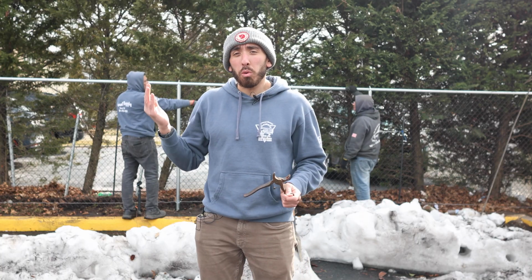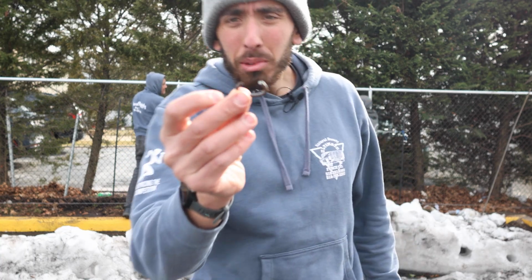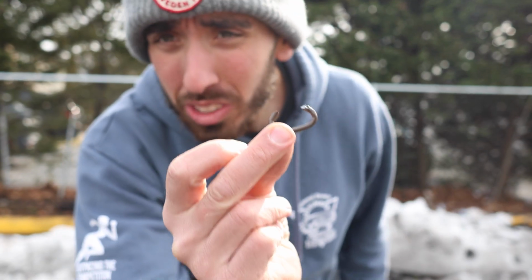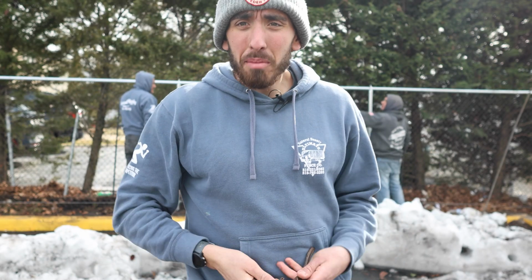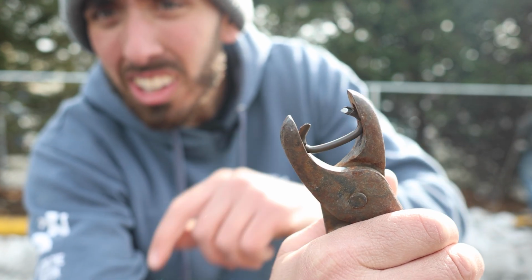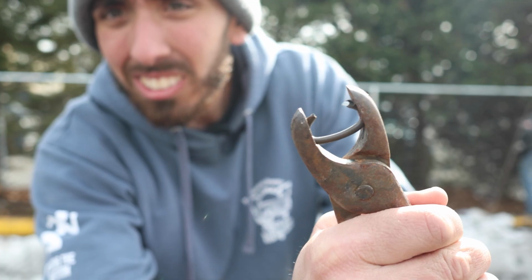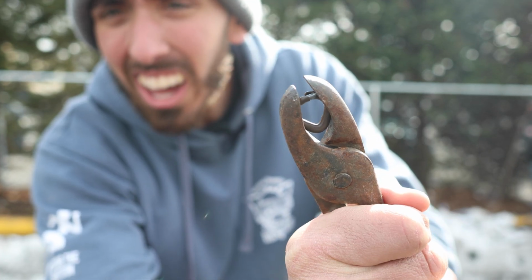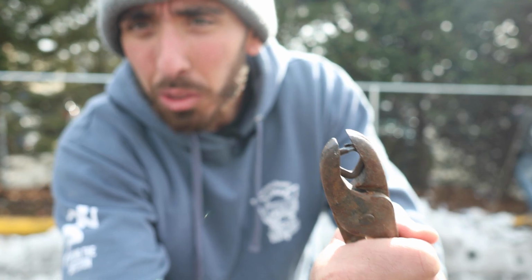To secure the chain link wire to the bottom wire, we're going to use hog rings, just like this. They're similar to the fence ties we're using to tie to the top rail. They're just a lot smaller. We're going to nestle them in hog ring pliers, just like this. Then we're simply going to nestle this into the chain link wire and the bottom wire, and we're going to squeeze it nice and tight like that. And that is going to secure the bottom wire to the chain link wire.